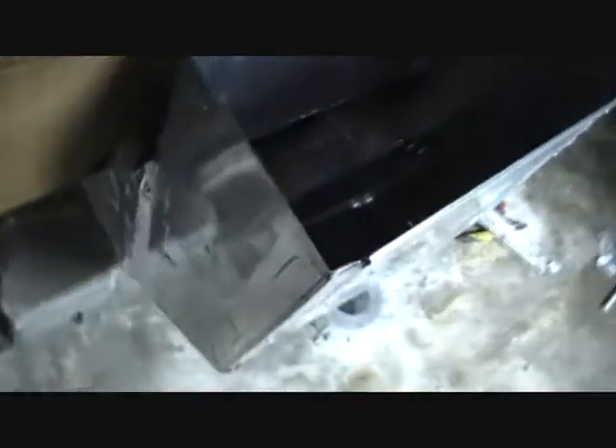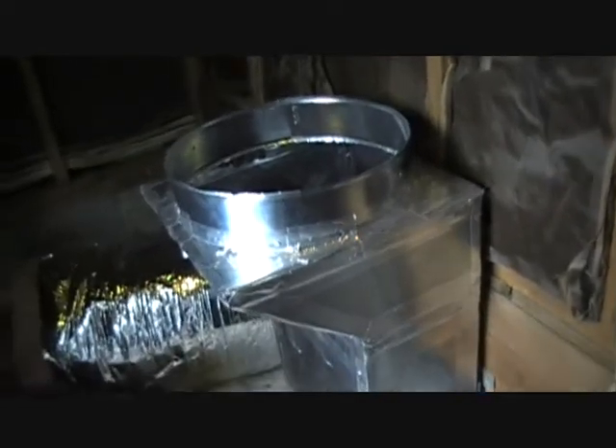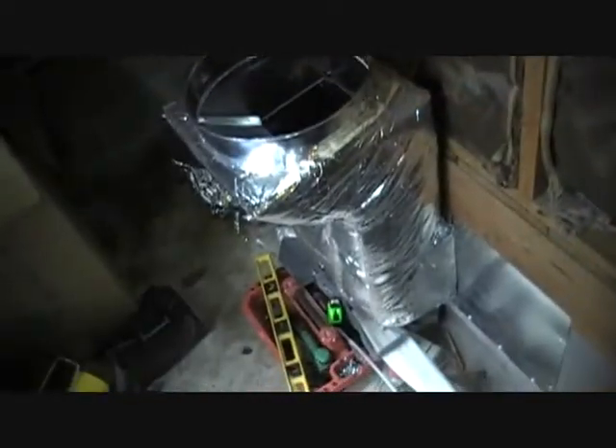There's a little turning vane. Everything's fitted up. I'm about to put the flare-out piece on top so it can flare out and go into round pipe. It's slow going building the fittings, but a little bit better for airflow and definitely a lot better for space. There's our duct fitting — it's all finished. It's going to transition around; the air will actually be going down into the crawl space for the supply zone under the house.